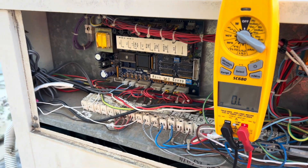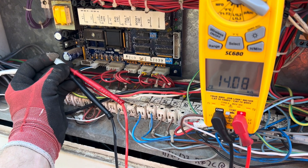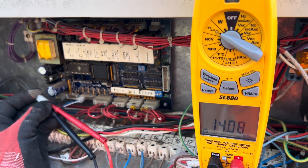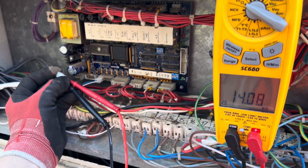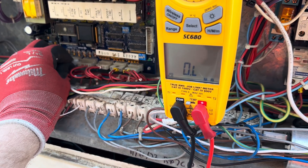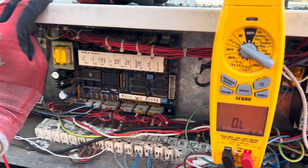At 16 to 17 degrees, the chart says the resistance should be around 15k, which matches what I was getting, and the voltage was 2.9 to 3 volts. That one seems fine — happy to pass it. I'll put that one back in, check the other one, which is only about a degree out. They seem fine. We might reapply power.